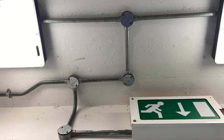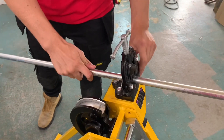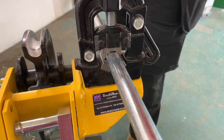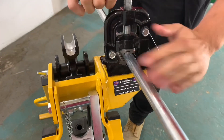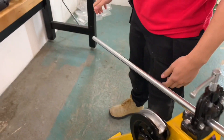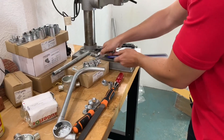If you wanna pop your conduit in, we're gonna make a cut in it first. So just remind me what the jaws of this vice are — it's a round jaw clamp. Why do we need a round jaw vice on our conduit bending machine? To make sure that we don't crush or flatten this conduit at all. So that's there. Now we've got our hacksaw, and it's important we get the blade in correctly and the right number of teeth on our hacksaw blade.